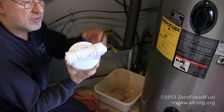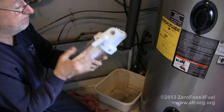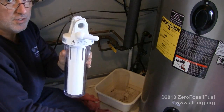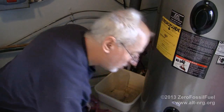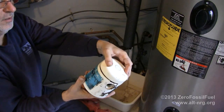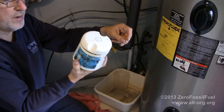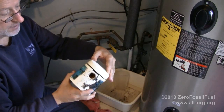Of course, you have to pay attention to what side is marked inlet and outlet because the valve is dependent on the water pressure to keep it sealed. But I like this handle mechanism that GE uses on their water filter as opposed to this type of valve mechanism, which you'd have to depress and then turn and let pop up. It was under water pressure, was binding very hard and very prone to leaking, so that's the reason we're replacing this.